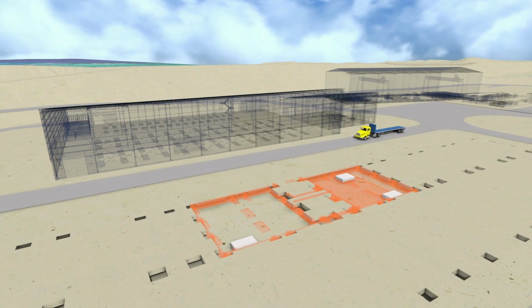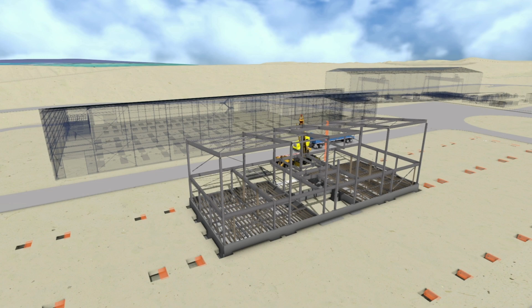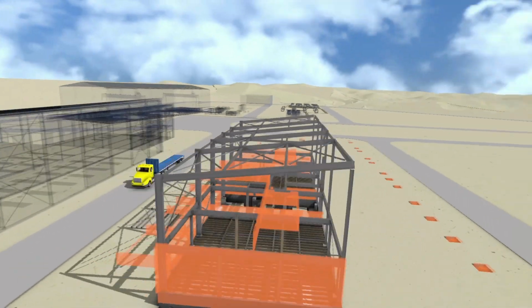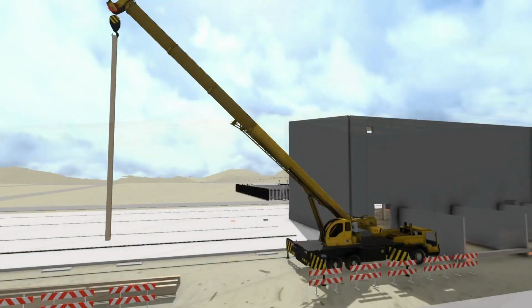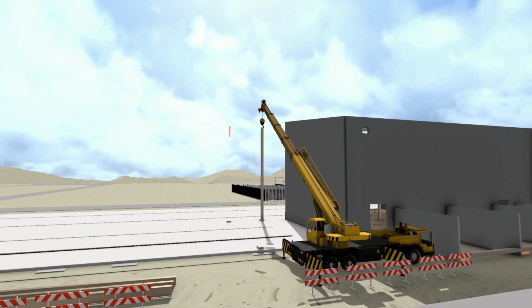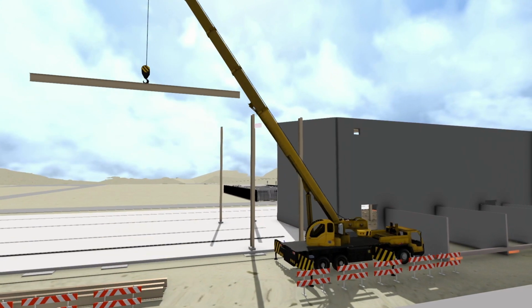The switch room is a two-story steel frame that is clad with precast concrete panels. The switch room design incorporates false floors to simplify cable routing to the control panels. The steel frame structure is a very cost-effective solution that allows a simple and fast erection sequence.